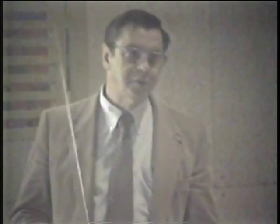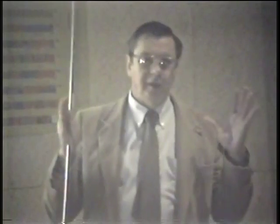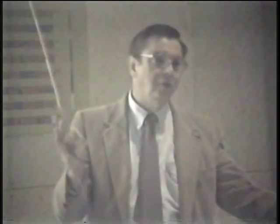The explanation as to why this is going to have an effect will come later, but let's talk about that. If you take an ordinary tape, which you rent or get from your friend, it's not going to be SuperBeta. You play it back on the SuperBeta machine with the SuperBeta switch on. Chances are you will not see any difference, but it depends on the quality of the recording. In the SuperBeta position, a lot of noise canceling circuitry and a lot of de-emphasis, pre-emphasis circuitry is changed, which allows much more high frequency to come through. And we know that if the information isn't on the tape that you're playing back, you're going to get noise, a grainy looking picture in the SuperBeta position.